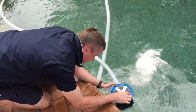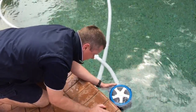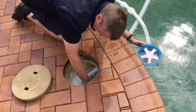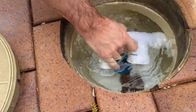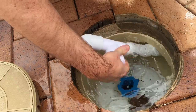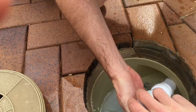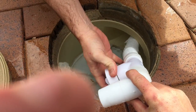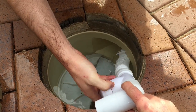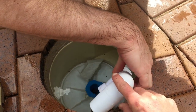That's maybe just a little bit too slow. At the bottom there's a speed control valve — screw it tighter to make it faster, or open it up to slow it down. What you're effectively doing is closing or opening a small hole in the back. Opening that hole creates more bypass of water and lowers the flow through the main pipe. Screwing it tight reduces bypass and increases flow through the main pipe.